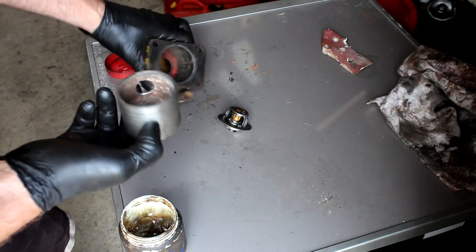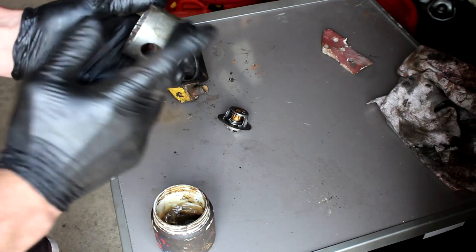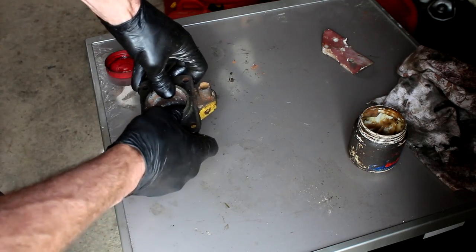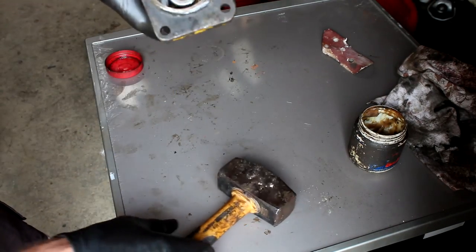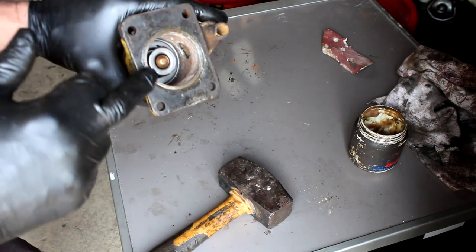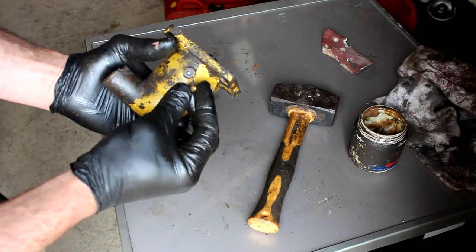Now I'm going to put some anti-corrosive lanolin-based grease over this so it'll hopefully stop the rust a bit and make it easier to pull out when it needs to be changed. I just have to line that hole in the sleeve up with the port. Alright, that's pretty good — that's in there quite nicely. So because this is just a little bit proud of that surface I'll get the grinder and skim it off so it's level. First I'll have to drill a little hole in there — that's the locating screw — and carefully drill a hole without ruining the thread.